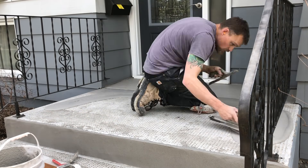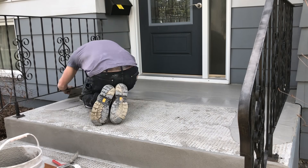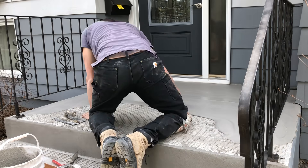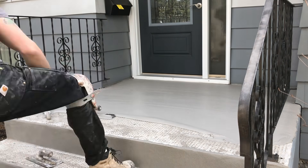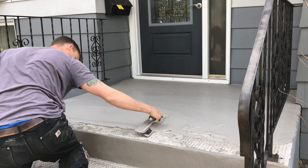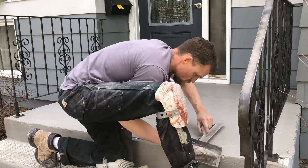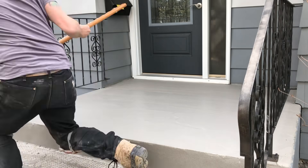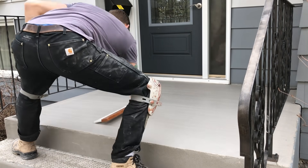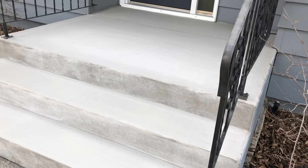I'm spending more time on this main pad here — you just spread your product at the top and start working it back. I'm using the trowels along the edges to prevent material from overflowing. We do have some good skim coat videos covering edge trowel use and broom lines in more detail. You can see I'm using the broom by hand without a pole — the restricted space with the railings made it hard to keep it on a pole — going back and forth trying to get the lines as straight as possible. I continue that same process for the two treads as well.